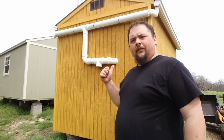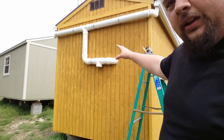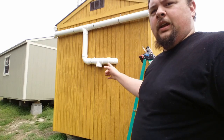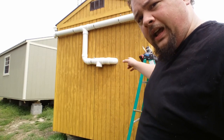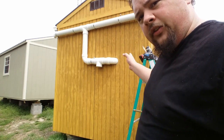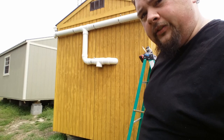Just like that, we've got water going inside of the utility shed. Basically what I did — you can see the T right there — that's going to go down into my first flush diverter, and then it comes out of the first flush diverter. I had to cut a four-and-a-half inch hole in the back of the utility shed, and that's where the water goes in. It's going to flow into the tank, and I'm going to take you inside in a minute and show you how that's going to go. But first, I'm going to go over this first flush diverter.